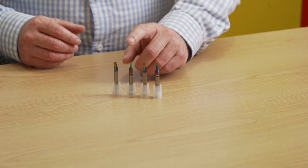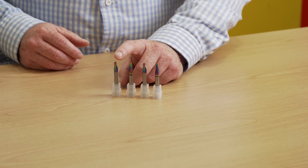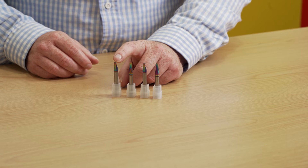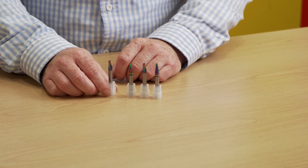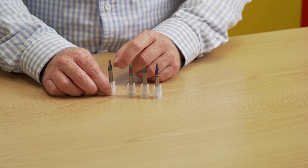What we have designed and what we'd recommend for cutting ACM is what we call the DLC cutter. These cutters have a special DLC coating — diamond-like coating — which helps stop the aluminium gumming into the flute and sticking onto the cutter.